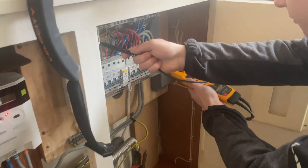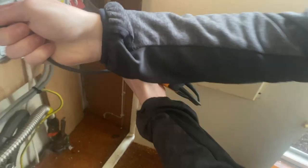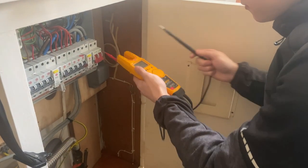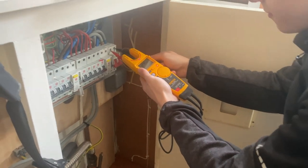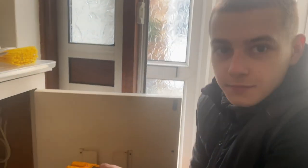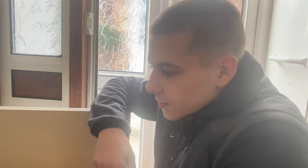All possible combinations - we're doing all the tests. And then if you can just go to the top again, just to prove that that tester is definitely working. You're just proving that them testers are working, yeah? That is your known supplier - it's what you call a known supplier. So we're proving that them testers are working, then we're proving that it's dead, and then we're proving that they're working again.